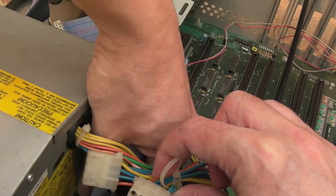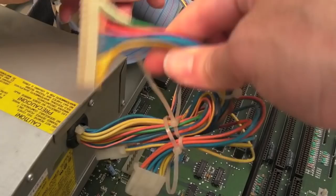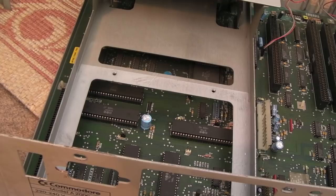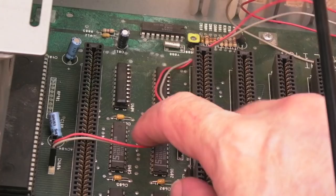There's one screw on the back and two screws here. I'll carefully pull the floppy connector off and disconnect the power. Now I'll disconnect the cables from the back of the drive and pull the floppy drive out. The power supply should come straight out. There's some good news: through the little gap you can just see — 8372A! So it's the one-meg chip version, which is nice.